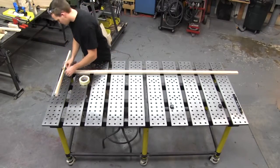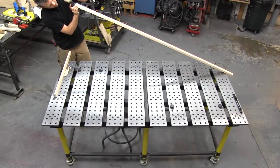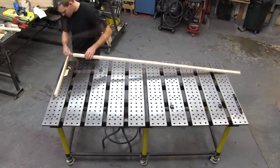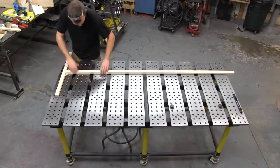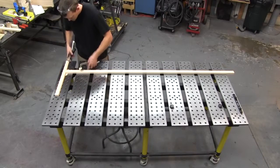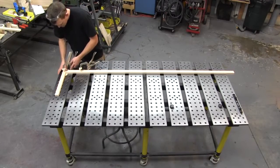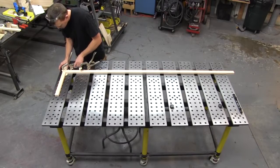I used a similar technique to glue up the long pieces. I put the stop bracket at the end of the table and glued up the 2 pieces. They referenced off of a couple of stop rest buttons to register the pieces at a 90-degree angle to each other. And then I used a couple of shorter bar clamps to squeeze the joint together.